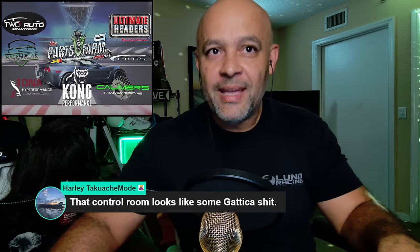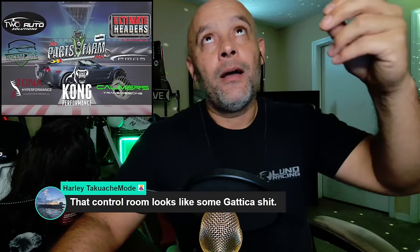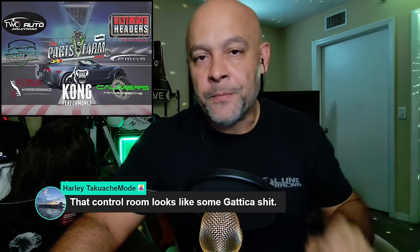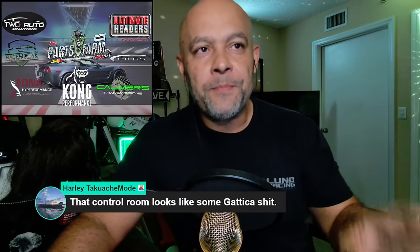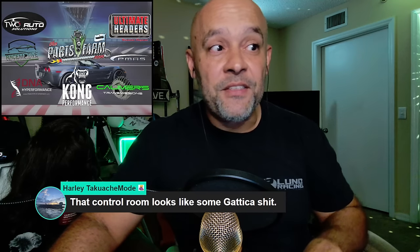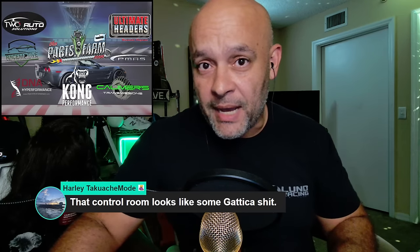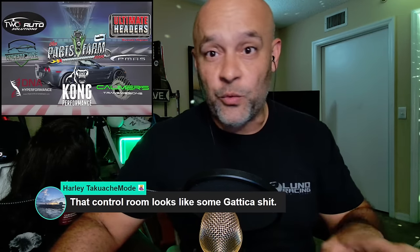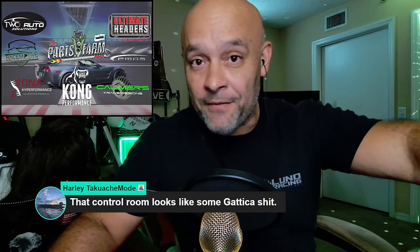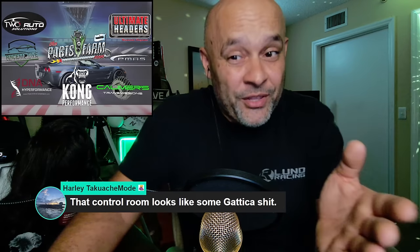So if Ford offered a ring gap for supercharged applications in their NA Alluminator, I think you'd be okay. But honestly, based on what I've seen, even the NA Alluminator has had zero issues when boosted up to 20 pounds on turbos or supercharged with 25 pounds or so, and they've gone well into the eights. And if you put it in a Fox body that weighs 2,800 pounds, that's a 7 second. You could do that with a stock Gen 2 motor.